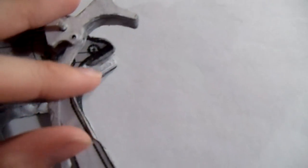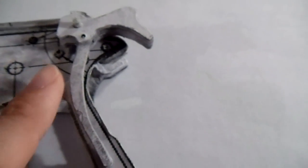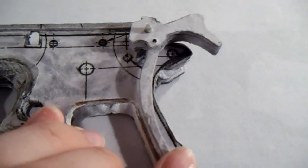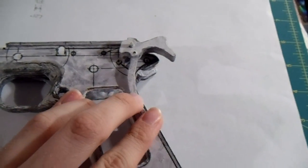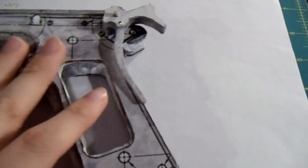This is the function of it: say you pull back the hammer and this goes down, pushing against the mainspring. Then you pull the trigger and the sear is removed from the hammer — the sear will be in those little notches. Tacom1942 has videos showing that function. The mainspring will then push up on that, raising it and knocking against the firing pin — like that. It's a pretty simple design. Thanks for watching and stay tuned for the next episode.